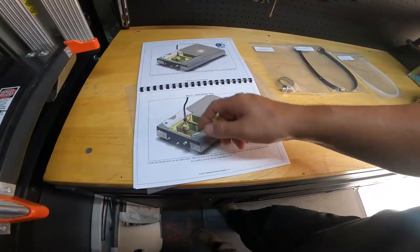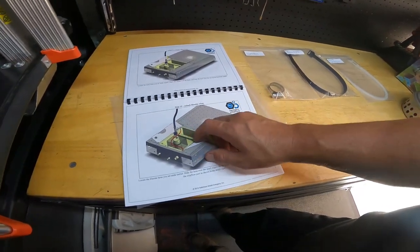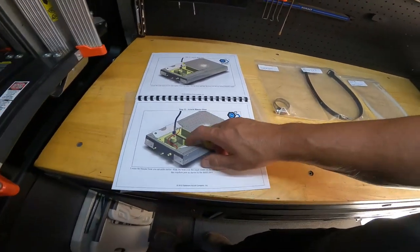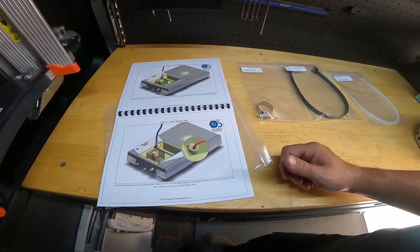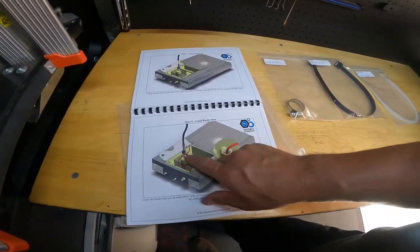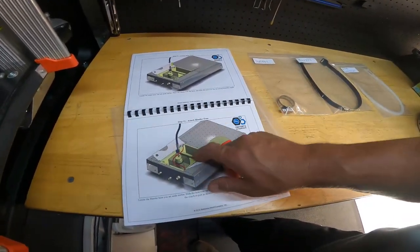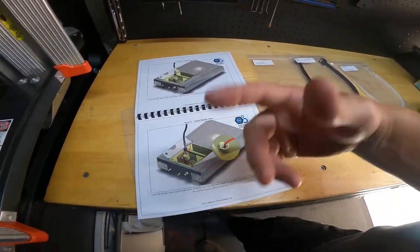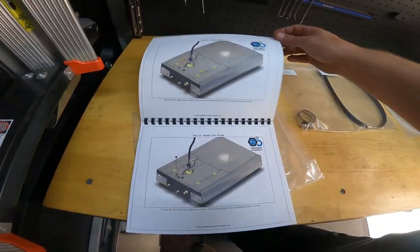And you put this in here, and sometimes you can put some chlorine tablets in here if you need to, or biocides, just when you're doing a rinse. It's going to drain immediately right after, so I don't stick something too corrosive in there, because it will eat the pan. Even though it's stainless steel, chlorine does attack 304 stainless steel, and at some concentrations it could attack 316 if it's overheated. So you want to make sure that you don't do that. If you run a chlorine solution to clean the pads real quick, or you're running a biocide if anything is growing on your pads, make sure that you put that in, recycle it, and then drain it right back out. So most likely a liquid form, not tablet form.